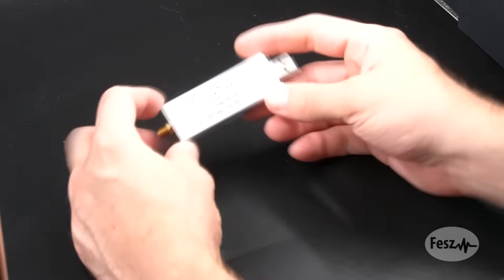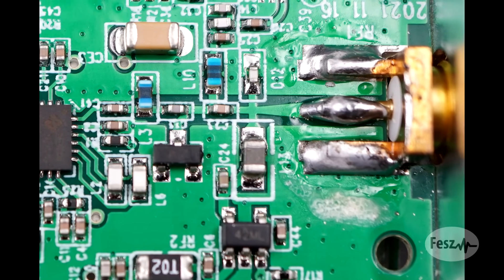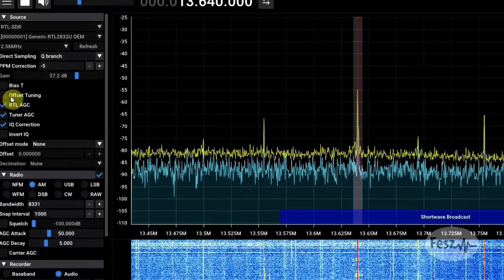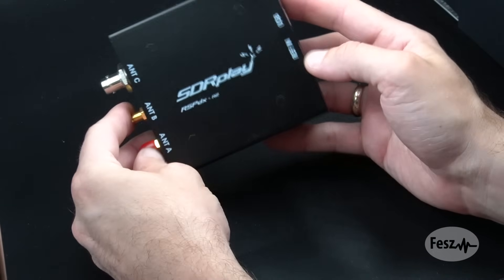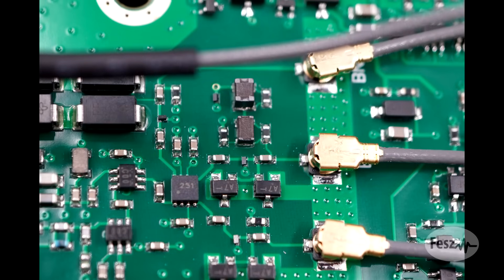First thing to consider is whether you actually need the BIAS-T or not. If you have an amplifier down the line, surely you need to supply it, but it's important to first observe if the receiver or circuit that you are using doesn't already have a BIAS-T built into it. What I have here is an RTL-SDR, and if we look closely on the board right at the RF connector side, there is a series inductor with some sort of high-side switch supplying it — this is usually activated using software control. In a similar fashion, this SDR Play has a BIAS-T built with 2 ferrites in series, providing a bit better isolation and probably a wider bandwidth. Having the BIAS-T already built into the receiver brings a few important aspects into play: it's already there, so you don't need to bother adding another one. However, this only works if the supplied voltage and current are sufficient to power the intended circuit.